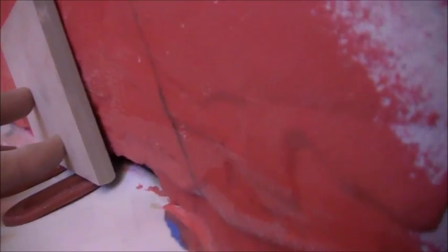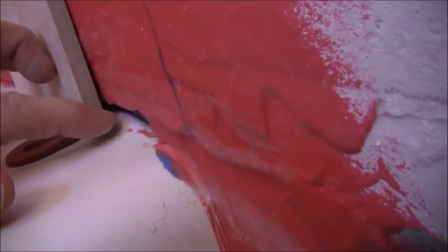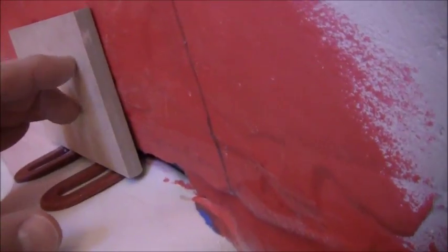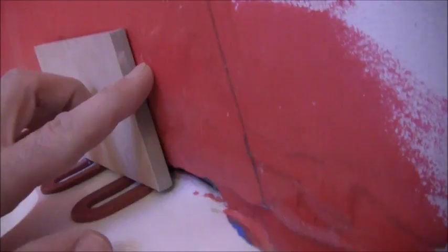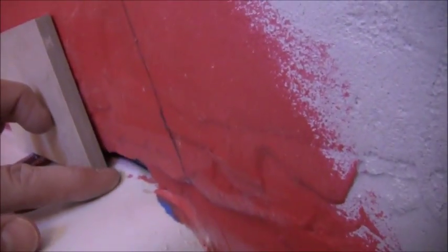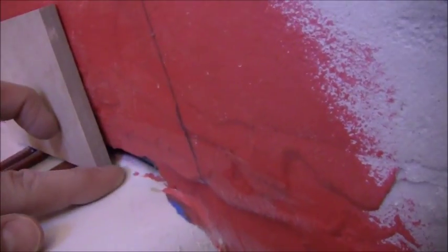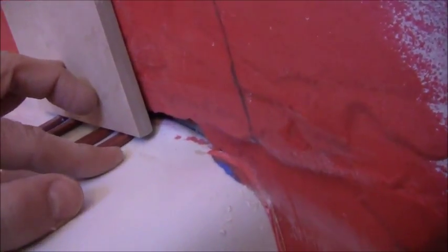And then you can see that I've got a gap in between back here so that if water comes down past, for some reason, past this wall to my RedGuard waterproofing, it will come down, drip onto here, there'll be grout here at the bottom, which is porous. It will come through the grout, over to here, and then hopefully into the tub.